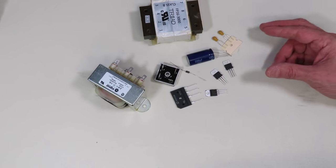Here's the circuitry for the variable positive test: transformer, bridge rectifier, and filter capacitor, with the LM317 connected. We also have a voltage divider built with a 220 ohm resistor and a 5k potentiometer — this is how we adjust the output voltage. I have an output capacitor — I used a tantalum, but you could use a ceramic. At the filter capacitor I used 1000 microfarads, and for the output, 2.2 microfarads.